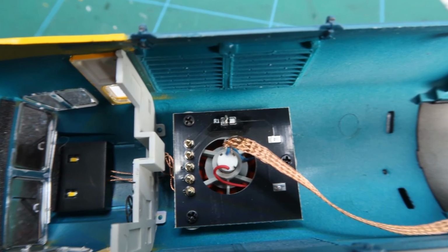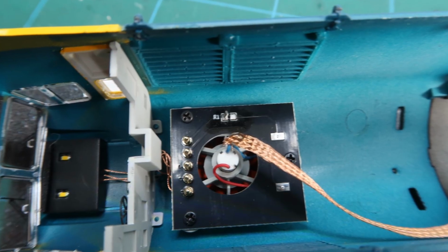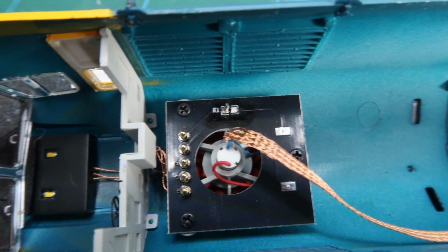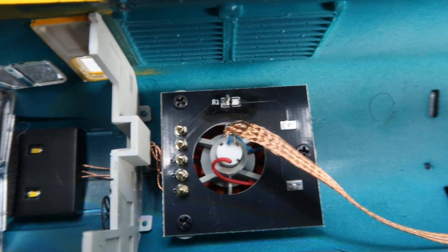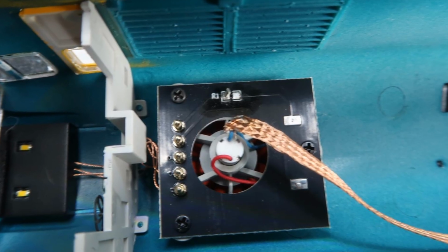Moving on, set the body into a service cradle that will be very steady. Select a fine tip for your soldering iron and a temperature of not more than 600 Fahrenheit. Using eye magnification and being very aware of the position of the body of your soldering iron at all times, making sure it can't touch your Class 50's body and badly melt it.